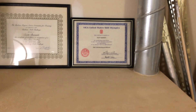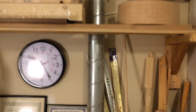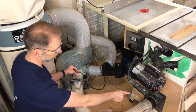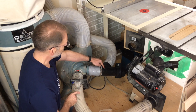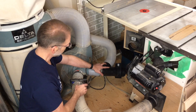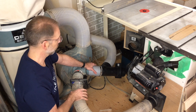This dust collection hood is also where I keep some milestones — this was from the United States Skill Olympics where I represented Canada in the cabinet making competition in high school. Let's follow this duct up to the ceiling, across, and down to the dust collector. At the dust collector, I've got several different runs: one goes to the table saw base, one goes to the miter saw on the other side of the room, and this is a new Y-joint I've just put in to try to add dust collection at the lathe — it's a really tricky task. If you've got any tips, let me know. With several different runs, it's important to shut off the ones you don't need so you've got optimal suction where you need it.